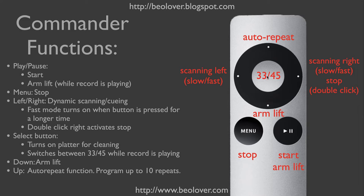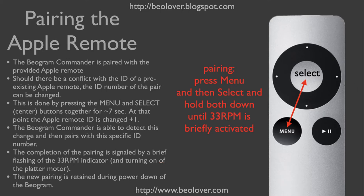The select button on the remote is used to switch between 33 and 45 RPM. This button is also used for the platter swipe function — if the turntable is off and you press this button, the platter will start moving and you can swipe your record before you activate the start function. The commander board comes with a paired Apple remote, which sends out a specific ID code before sending a command, preventing crosstalk with other Apple devices in the same environment.